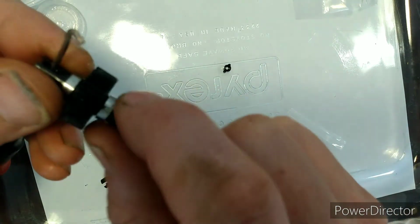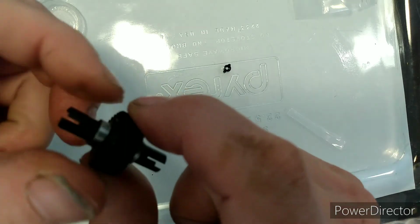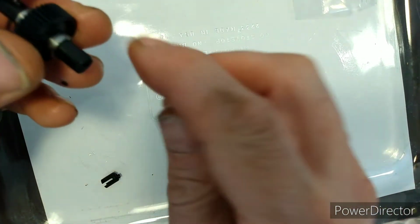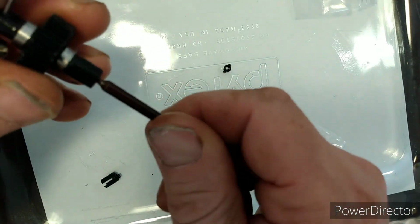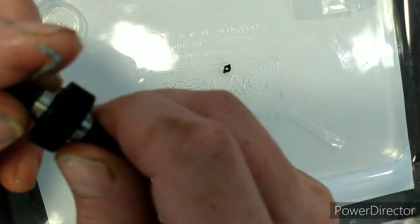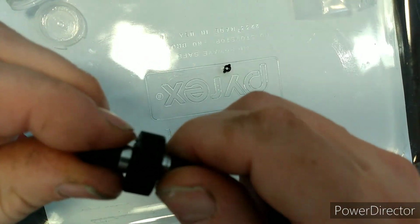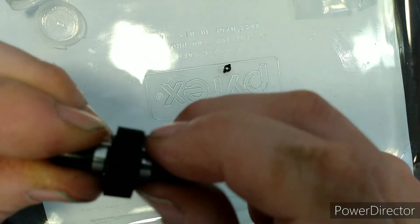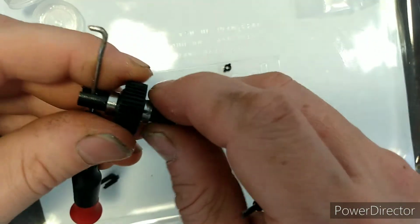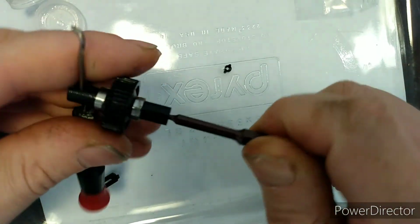I'm gonna say, while you're doing this, keep rotating the assembly. Keep feeling for anything weird. Make sure you don't feel a gritty spot starting to develop or anything like that. I'm just saying from other rotating assemblies similar to this, as you begin to tighten it, you want to keep rotating the assembly and make sure everything's behaving properly. You gotta stop and make sure everything makes sense while you're doing stuff. You stop and ask yourself, does all this look right?